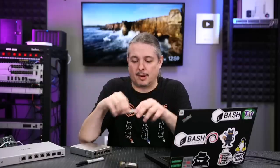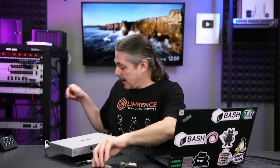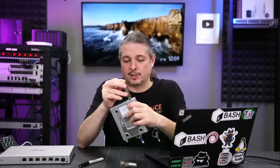We don't put a lot of these in production. Most of the time when a client is speccing something out, the servers are all connected either via DAC or fiber optic cable, and we don't use RJ45 for long 10-gig runs unless connecting to PCs. I did do one other test with that same cable: I got a few errors on the FS.com adapter, but when I plugged it into the native RJ45 ports on this switch, there were no errors at all in the transfers — it went perfectly fine. Also of note, someone mentioned these adapters may cause problems because they pull more wattage, but the watts are limited by whatever the manufacturer designed and specced, so I don't think that'll be an issue.